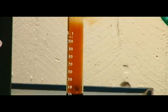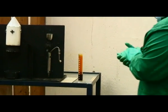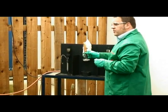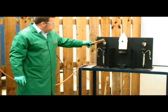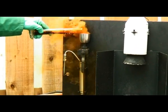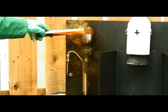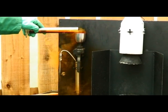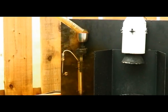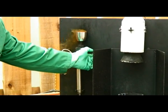There is my N2O4. I'll shut the cylinder and remove it to the side. Now I'm going to pour the N2O4 into the oxidant tank. As you can see, the vessel is a little bit warm so it is actually evaporating the N2O4, but as you pour it in and it cools it will stay liquid inside the tank. Let's close the tank now for the N2O4 — this is the oxidant.